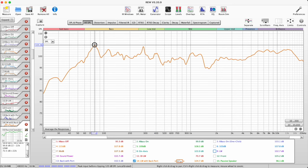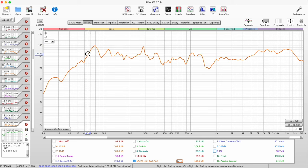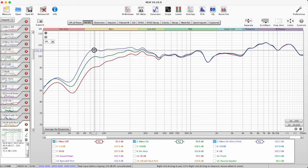With the back port included in the measurement, the peak is around 78 Hz at 104 dB near field. Three dB down from that puts us around 65 Hz — that's the F3 I measured. Ten dB down from that is around 45 Hz, which is about the lowest bass you'll probably hear in-room. This aligns pretty reasonably with what they've stated on their website. Looking at the differences between X-Base off, X-Base on, and the higher X-Base setting — this blue line is the one I preferred, and all previous measurements were taken with that setting.